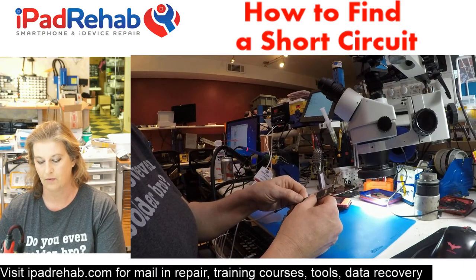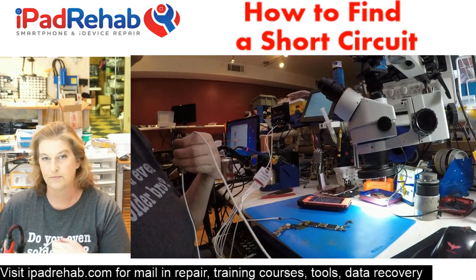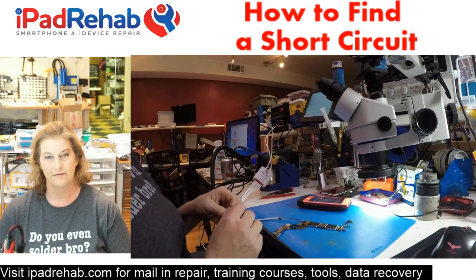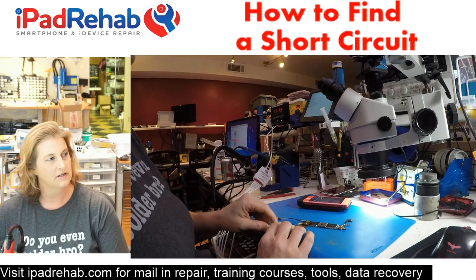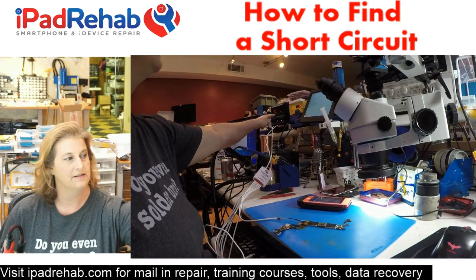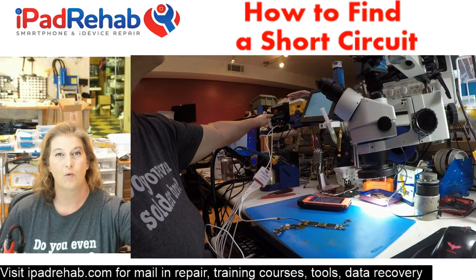the main power rail. But when I plug it in and prompt it to boot, so I'm going to prompt it to boot, I'm going to prompt it to start opening up all of those lines and sending voltages down all of the baby power lines. I'm going to prompt it to boot, and I can see over here on my DC power supply, this says 0.76, so that is almost 1 amp.